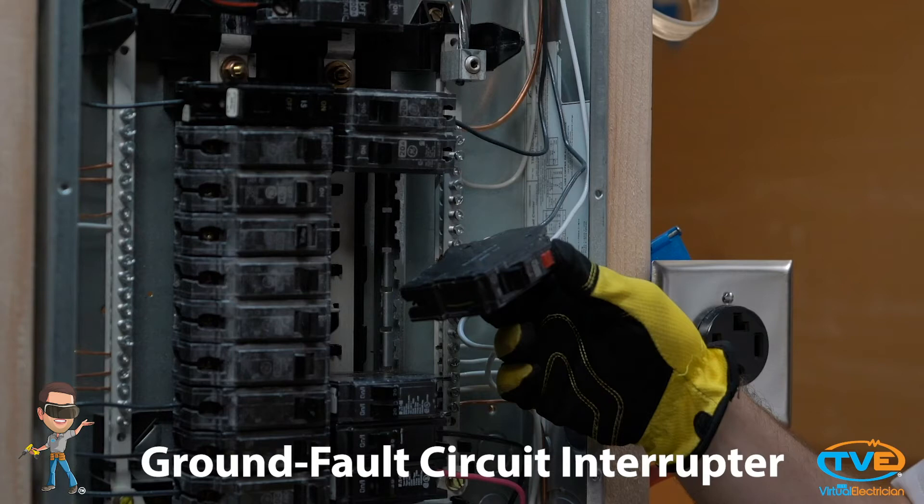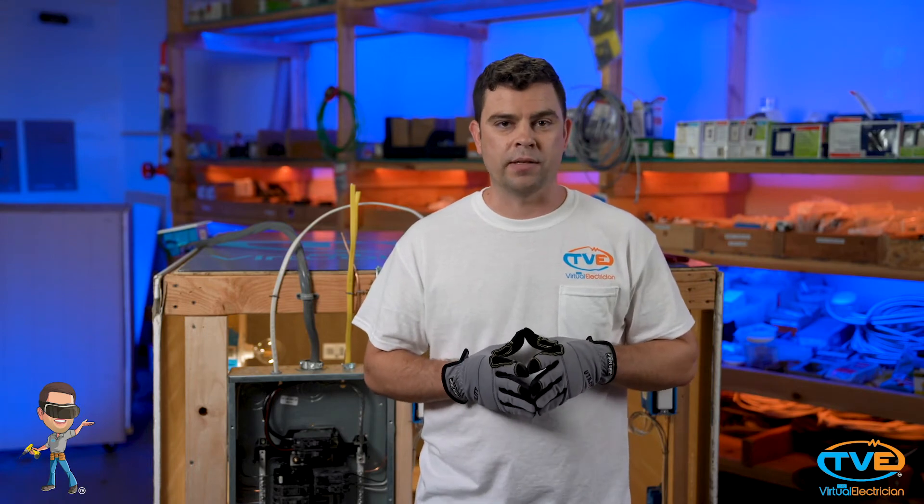You may choose to install a GFCI breaker and then label the outlets as GFCI protected, but I've seen this cause some nuisance tripping if the electrical system has other problems — not just not being grounded. Reverse polarity is an example of this. That's why I prefer to install GFCIs at each outlet location instead of GFCI breakers.